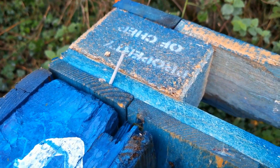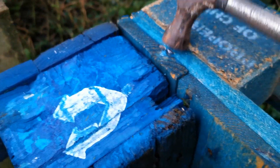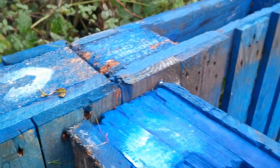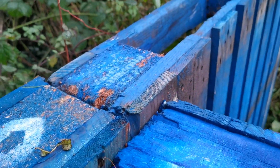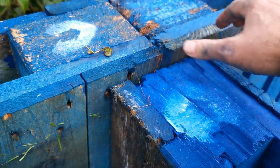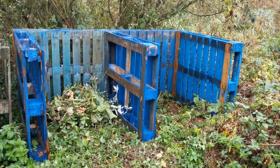I'm going to pop some nails in to start holding these boards in place, then put the final section on this end and we're done. This first nail goes in at around 60 degrees, hammering it straight in. I may lift this one up slightly so the top looks neat by putting a little soil under that corner, then put a nail through here and through here so this one is held in place against both of those two back pallets.